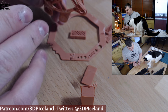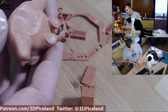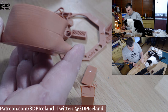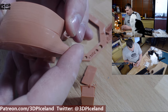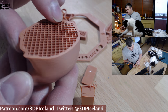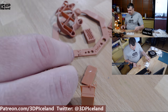I then tried the Omnob model and that was splitting up — layer adhesion was not very good. This model I got to stick pretty well on the bed after cleaning it with acetone and isopropanol, but then I got splitting happening in the part. This was printed at 240 degrees on the hotend and 90 degrees on the bed, inside a closed enclosure at 40 degrees — so it was very warm — but I still got splitting and ended up cancelling the print. After all those tries I had a little bit left and was simply unable to get a successful print.